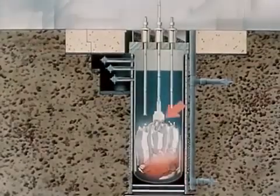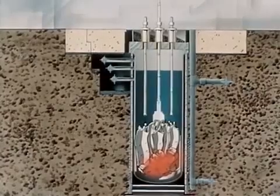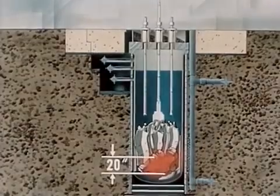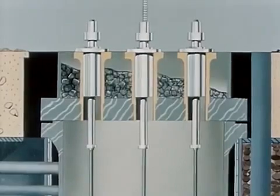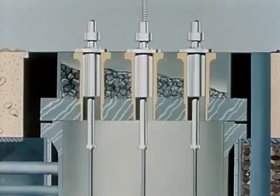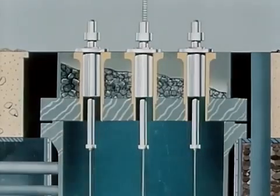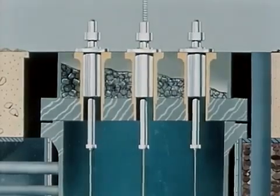The central blade was seized by the shroud surrounding it and the two became an integral unit. At this time of seizure, the central blade was withdrawn about 20 inches. The steam being generated pushed upon the water that was above the level of the core, forcing the slug of water upward from the core zone. It was stopped by the vessel head, with a resultant water hammer causing peak pressures of about 10,000 PSI.